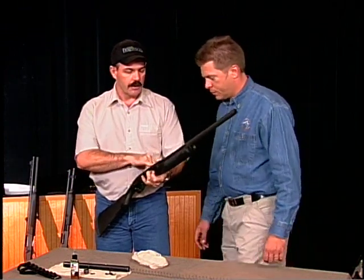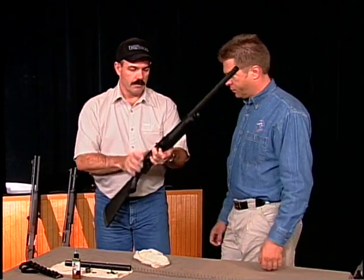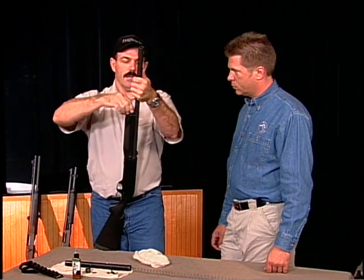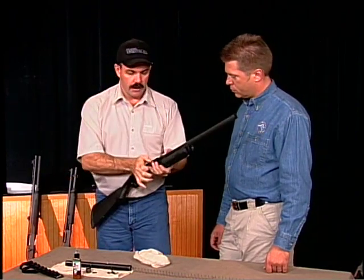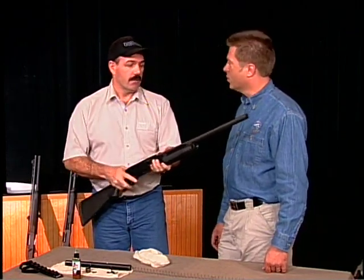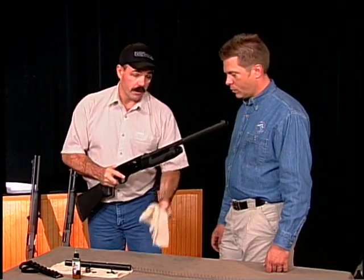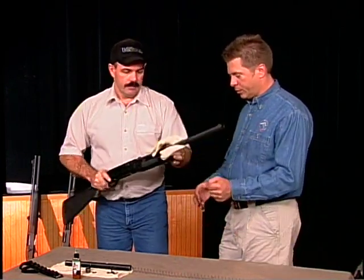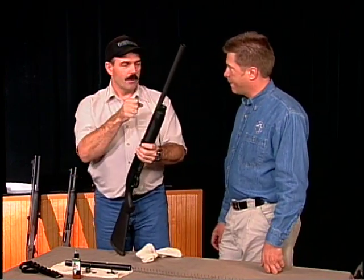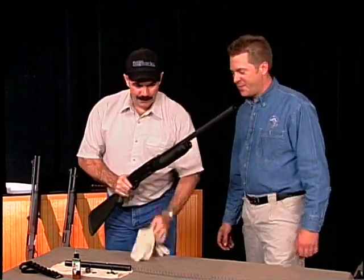Yeah, if there's a tolerancing issue in here at all, tighten that down and you can see the difference going counterclockwise. On some guns, you can rotate it into the bolt and actually, this one's not going to work. You can actually stop the bolt from cycling. Okay. So sometimes there's just enough of a wobble in there that it can affect the operation of the gun. So just go counterclockwise with the barrel, clockwise with the nut. Well, and if you get confused as far as left and right, do it one way. If it tightens up the bolt, do it the opposite way. Okay. Kind of simple, but...